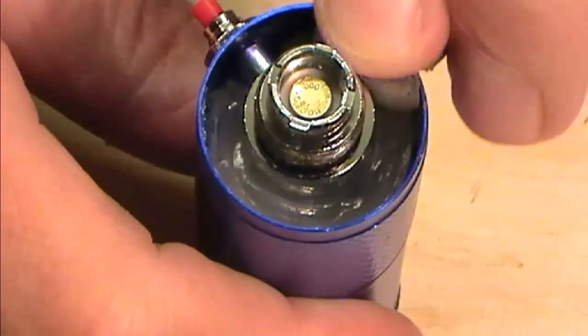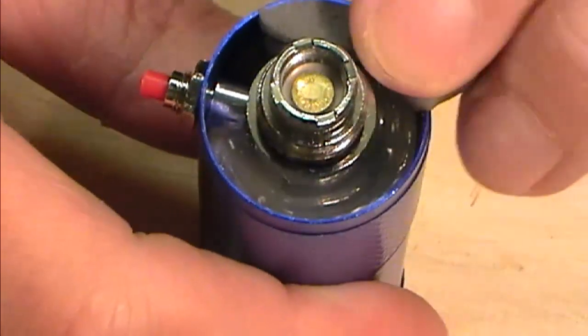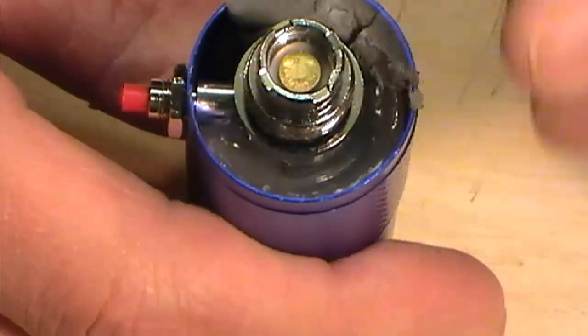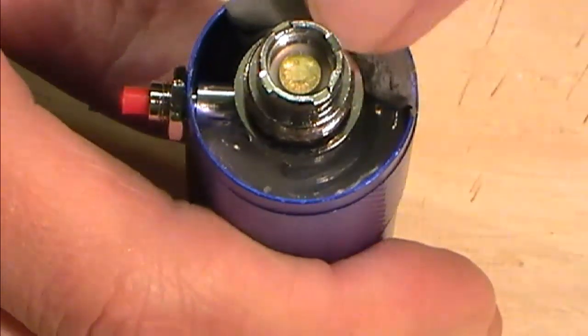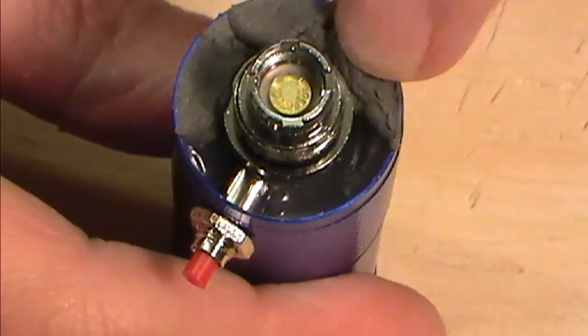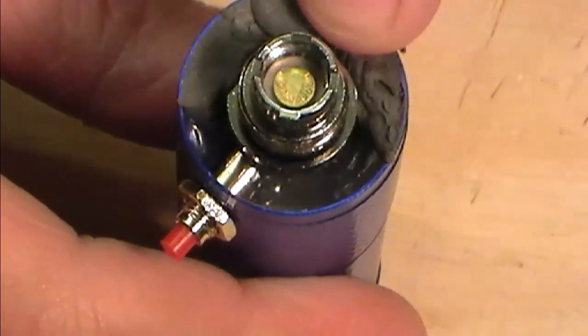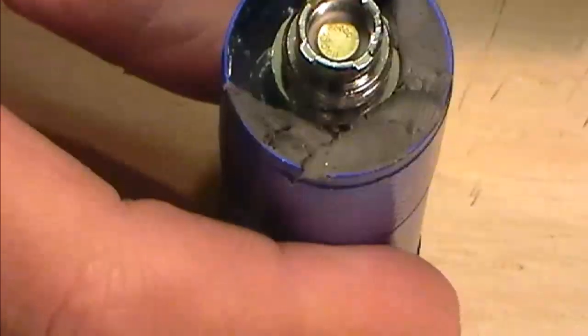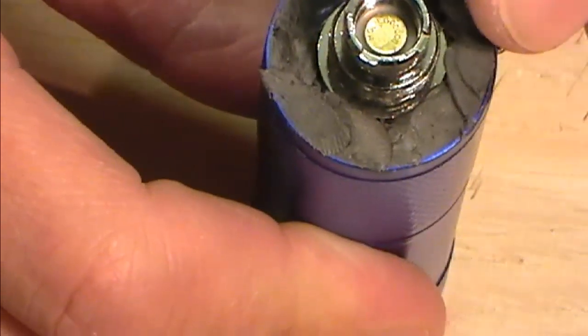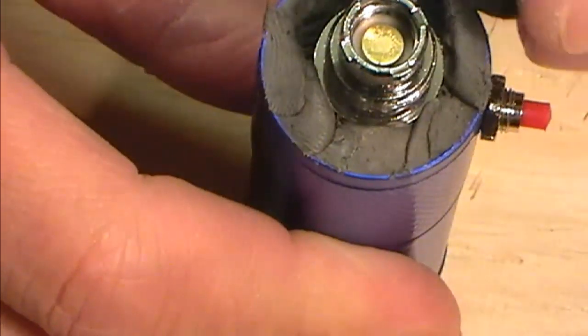into this joint here. And what this is going to do, our glue's given us, if you like, a first fix, like a little hold there. But this epoxy putty, and all I'm doing is using the body of the torch here to get this pressed down in. This is going to harden up right the way around the outside, and this will give us an absolute solid connection.